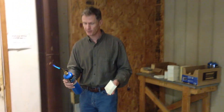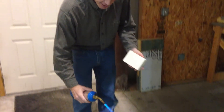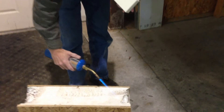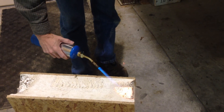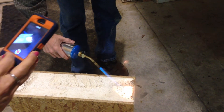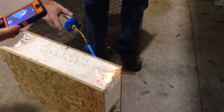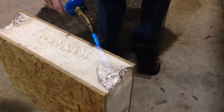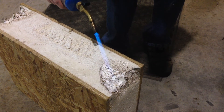There's about 3600 degrees Fahrenheit, 2000 degrees Celsius. You can see what it does to polystyrene foam. They say this is class one rated foam, but it virtually just disappears. When you lose the web — the interior foam of the panel — you lose structure.